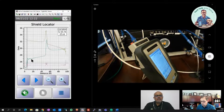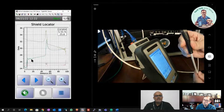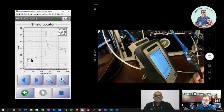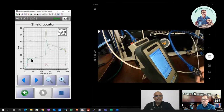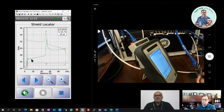Yes. So Steve, I believe the cable you have, the cable under test, is an FTP cable with a single shield around the 4 pairs. Whereas the permanent link cord that comes with the tester is an SSTP cable, right? So it has a shield around every pair, and then there is an overall shield. Gotcha. A significant difference in the shield coverage. Right. So that's why you see these steps in the step TDR.